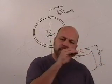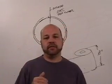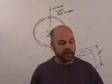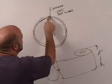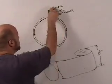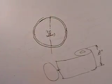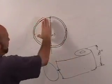And also, it removes any little dust or dirt or grit that might have fallen or stuck onto the end of that tape since you're unwinding it this way. And what it does is it gives you a clean, new line there. Okay, so I hope I'm right on that. If not, let me know. All right, so now he's cut it, okay? And now what we have is the tape is cut right there where it was originally affixed, right along the scribe line. And we've stopped about 2 inches short of applying this tape so far.